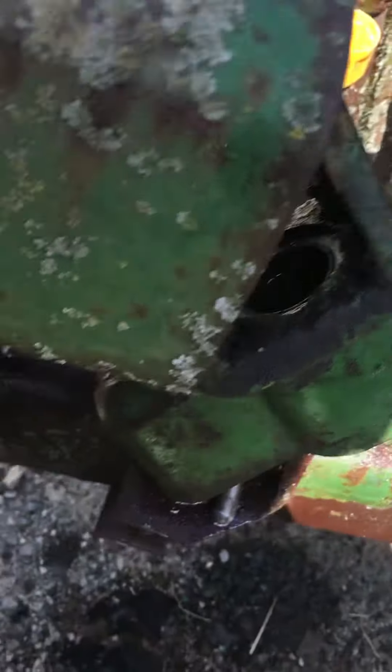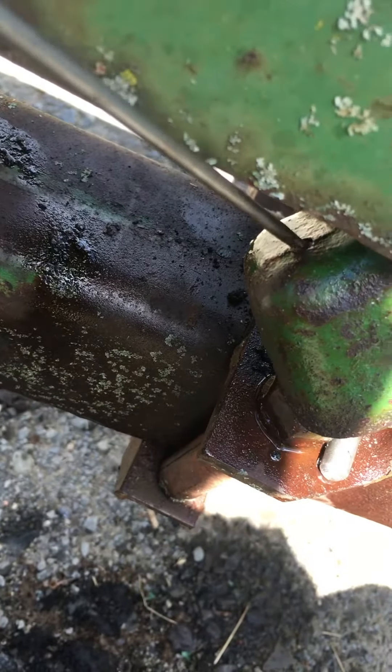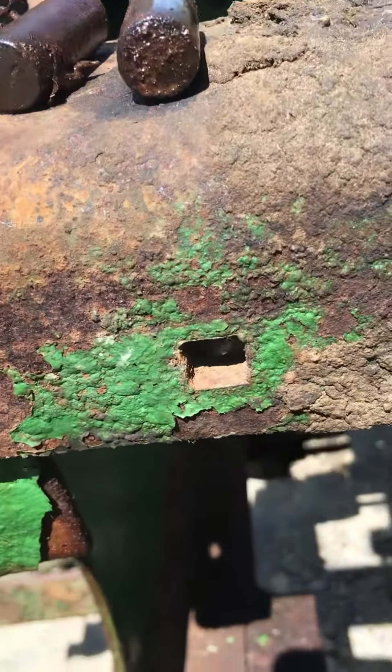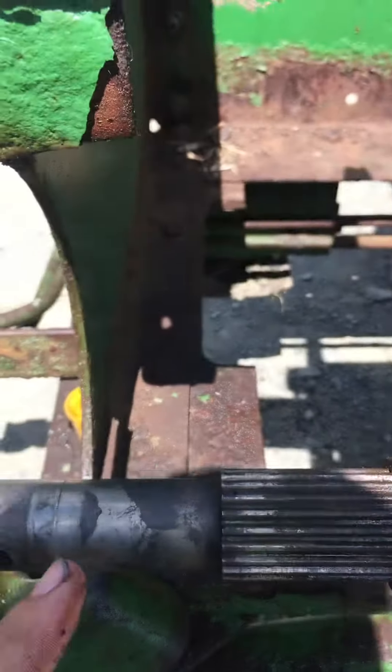During the season you can oil in there — both sides have it. You can see down here there's another one. You use a drift and you can knock out those pins right here by putting the punch in there. Like I said, I recommend cleaning these up and putting in new springs.